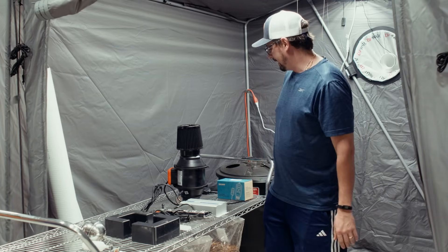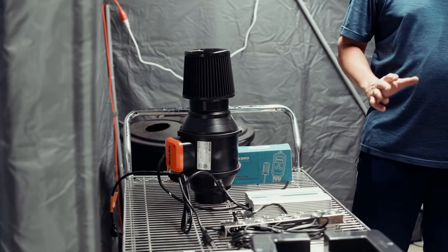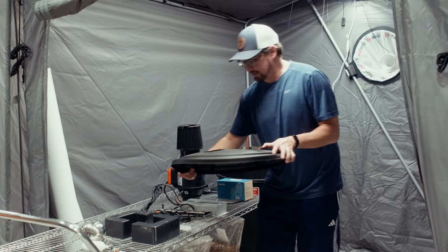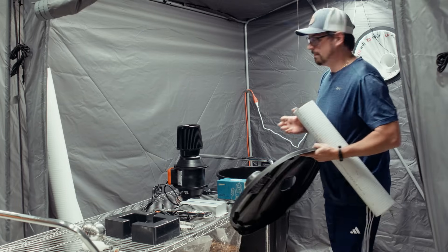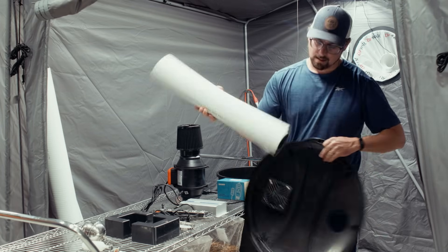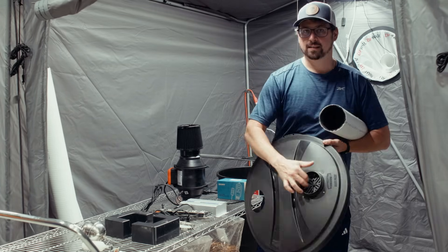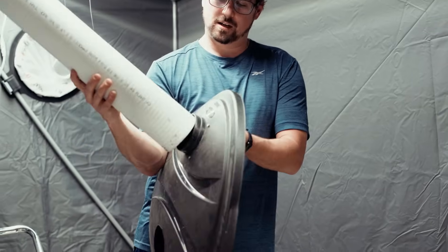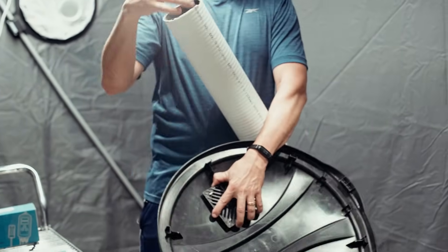After the UV light, you're going to want a fan and filter. This pushes fresh air into the system, and by displacement the humidified air comes out the other end. I used a hole saw to drill two four-inch holes in the lid — one to attach the piping. You can see behind me I've got one already installed in a grow tent using four-inch corrugated piping. I used a grate from Home Depot's gutter section attached to the lid to give the corrugated piping something to attach onto, and optionally a four-inch elbow to direct the air into the room.